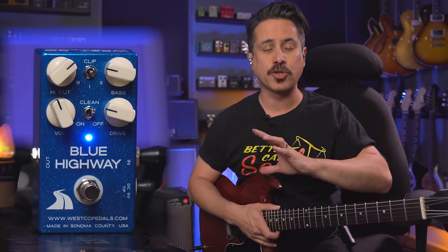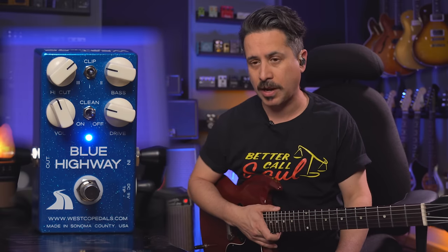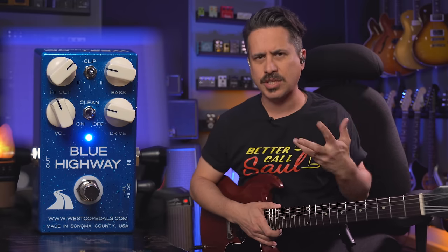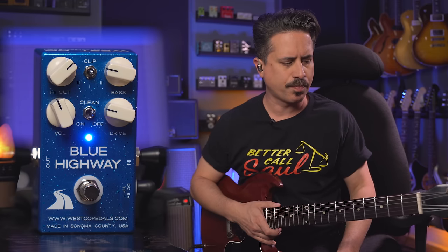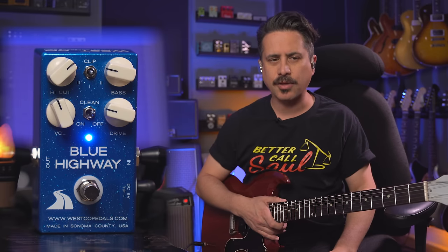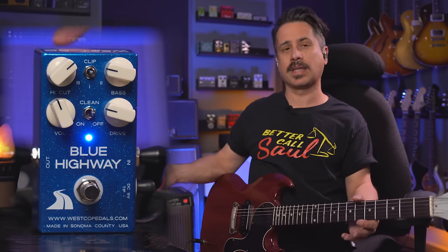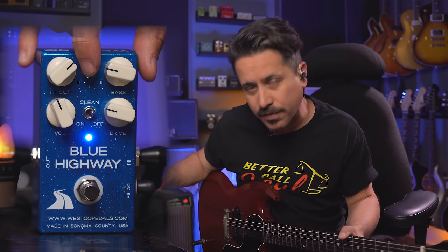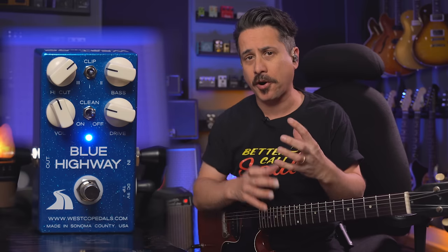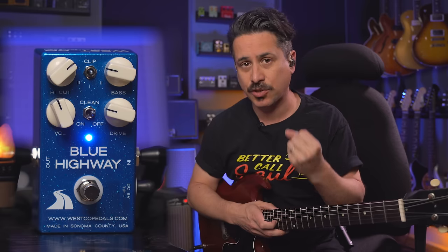The reason I'm not a huge tube screamer guy is because typically they have a really pronounced mid-range, which you've probably heard people talk about. Some of my favorites — like this pedal, the Greer Lightspeed, the JHS Morning Glory 2, the Gain Changer by Barber — I like those because they sound like I turned the amp up, just like what we talked about earlier. So when we take a pedal like this that has three different stages of clipping, what happens is the diodes in it are making it sound more compressed, more tube-like, adding more saturation and gain.